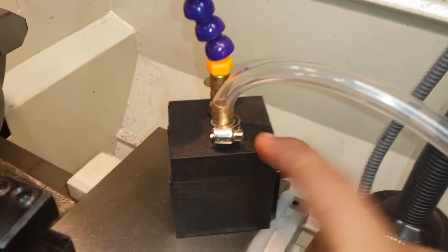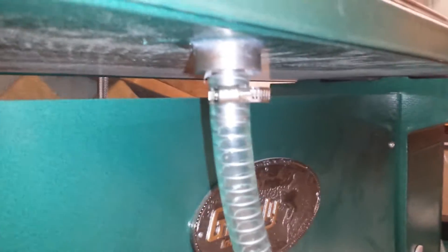This is a 175-pound magnet that my cooling system connects to. The hose comes down to my coolant system and my return valve comes up through the bottom — that's the piece I made. Then I just put this piece of steel on it. Because I have the four bolts, if I put this on there the liquid will flow under but I won't get any particles coming in.